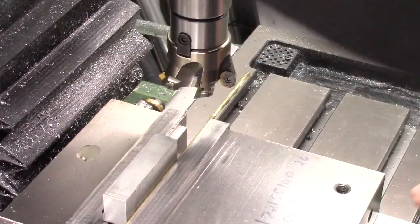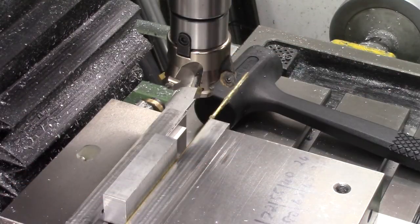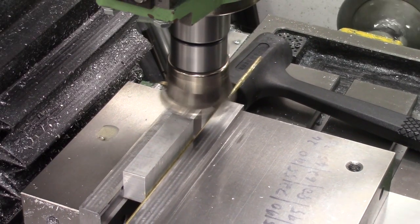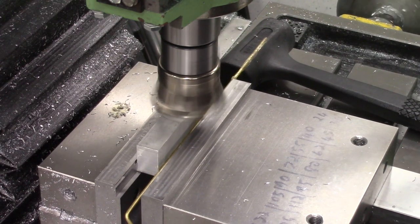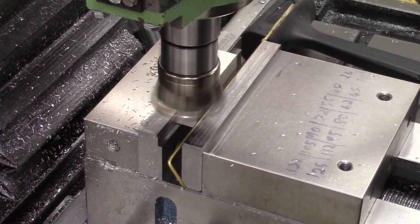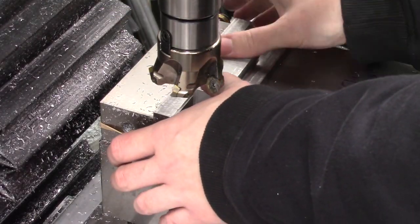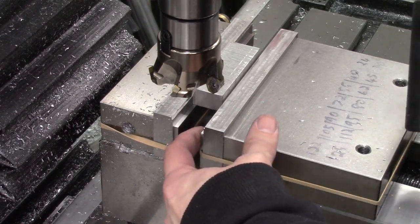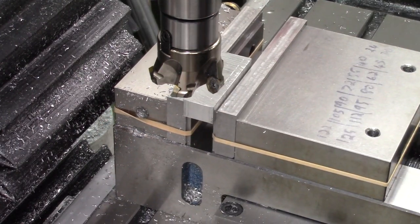Now as standard in the Katran, the folding stock adapter fits in the back. R1 is going to be a laminate fixed stock, so we're going to have to replace this and make a new one. It's not a very complicated item but it does have to be right, so we're starting off with that. The first thing to do when working in the mill is to square off the stock. In the background you can see me milling one face at a time, and the brass rod in the back is just a little trick we use in the mill to stop the stock rising when we tighten the moving jaw.